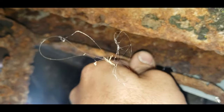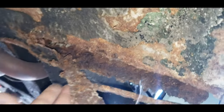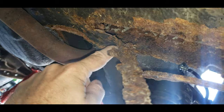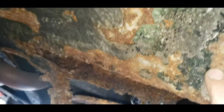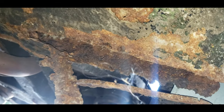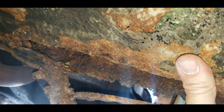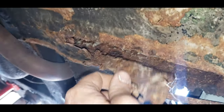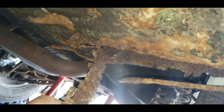Things are not fantastic under here because this is all rotted out from here to here, and there was like a little support beam or something that came across. My plan will be to cut out straight across and over to here, and remake basically a box — or half a box — that I can hopefully bang into position and weld on, coming up with some semblance of a floor without having to replace the whole thing. The rest of the floor is actually in good shape and solid because it's been undersprayed.